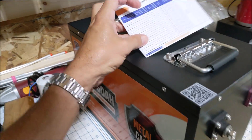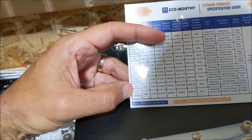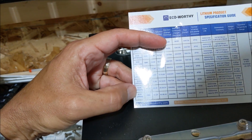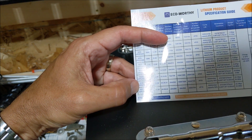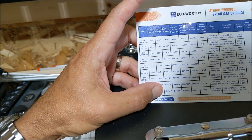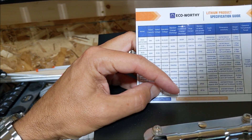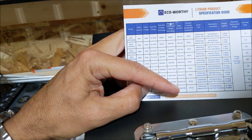For this battery here, we're on the bottom line on the grid. It's a 50 amp-hour, 51.2-volt battery — though when I put a meter on it, we were seeing 53 volts. It does say operating voltage 40 to 58 volts, 25-amp draw, and 300 amps for 10 seconds.